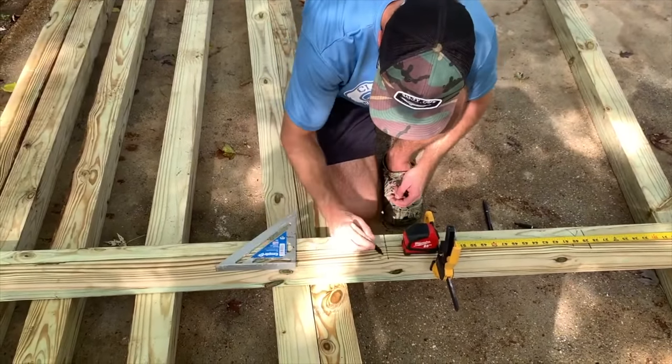After rolling the flex product, allow it to dry according to the manufacturer's instructions. In my case, this was about 24 hours. Here's a look at the product after it dried. So after applying flex, the next step is to apply a waterborne epoxy primer. For the Spartan epoxy system, this is the HDWB product.